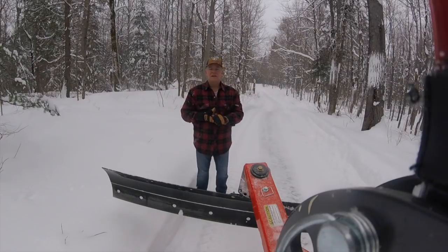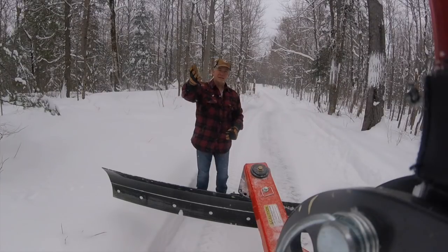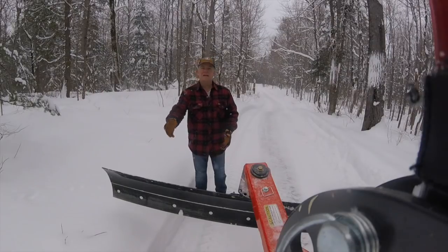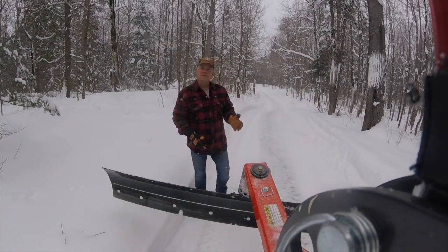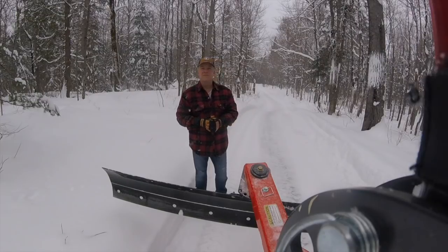Thanks to a couple of the subscribers I mentioned in my last video. I didn't realize that you can separate the brake pedals and use the brake pedals to help steer, which is exactly what I did down this last hill, this little slope that we just came down, because as it was pulling and the blade was filling with snow and it was trying to drag into these bigger snowbanks, you probably saw the tractor started pulling away, and I was able to step on the left brake a few times to kind of brake it a bit, to straighten it a little bit. So anyways, I'm pretty happy overall.